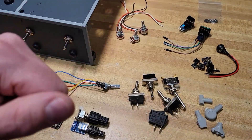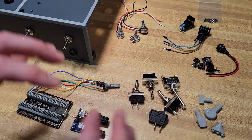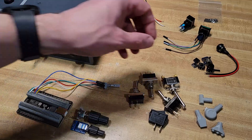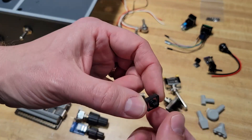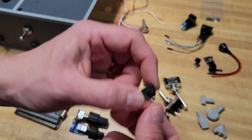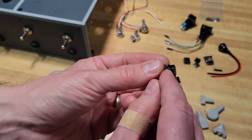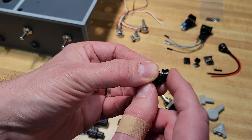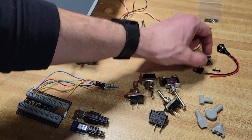With the way I've been building, I'm not using PCBs to mount all my buttons, not 3D printing anything or creating covers and spacing out panels. I'm trying to build something more generic. These PCB tactile switches - you can find a way to panel mount them, but I don't find panel-mount versions easily. You can get a panel-mount board to put them in, but for panel mounting you want the button to ascend above your surface, so it would have to be mounted in exactly the right position since it mounts to a PCB behind it.